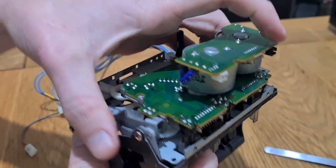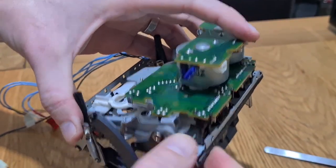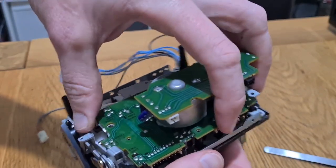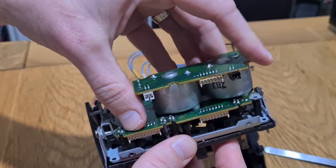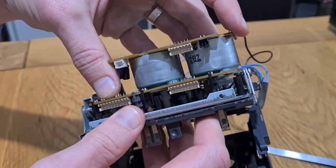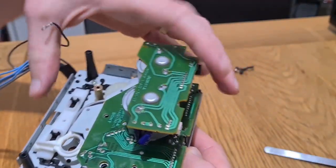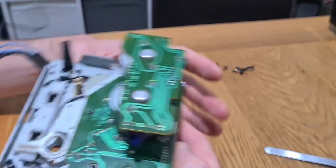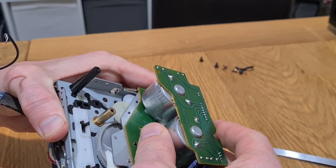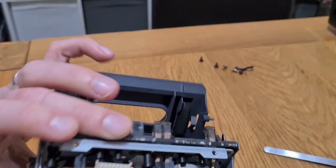Always think of everything you've not done before you start putting things back together. Line up your leaf springs, make sure they're right, stick them through the gaps at the top very carefully. Don't break or bend them because that plastic is very fragile — these are now 20 to 25 years old. The small belt is sat on those two black arms and is not going anywhere. You should feel a tiny bit of spring resistance. Make sure that square piece of circuit board goes underneath the eject arm, and then line everything up nicely.